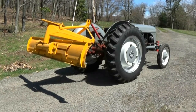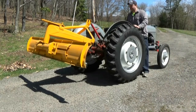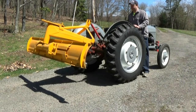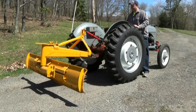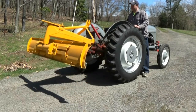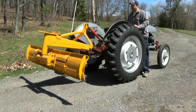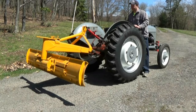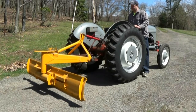So here you'll see me walk up, and I'm just demonstrating what it looks like after I restore the whole hydraulic system. There is no down pressure on these N-series tractors. You'll see it fall quicker than it goes up. That is about the speed at which they should go up. Notice there's no jerking or anything. I can pretty much stop the plow anywhere I want it to.